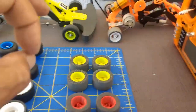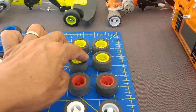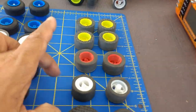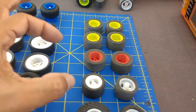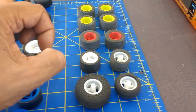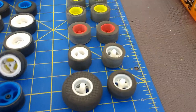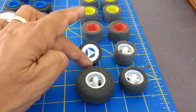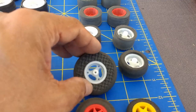You can laser cut the foam, or I use my CNC machine with the proper bits so they come out perfect. This is the inverse pattern of the other. You can do a lot with foam - you can put a pattern there with heat and even carve tire tracks on some of these wheels if you want a truck look. Here are some basic hubs. I don't like this simple hub - I really prefer these that have a little more design pizzazz. Look at that hub with the tire - it looks like a real hub and keeps the aesthetics of the model.